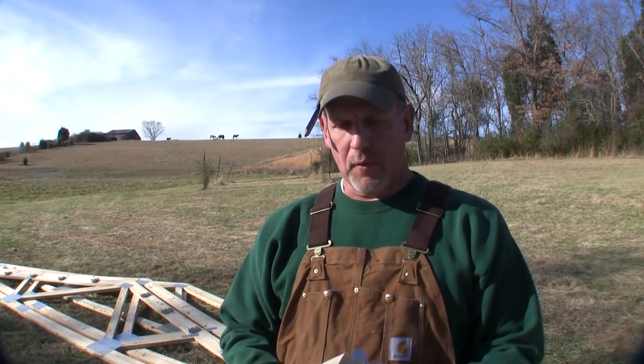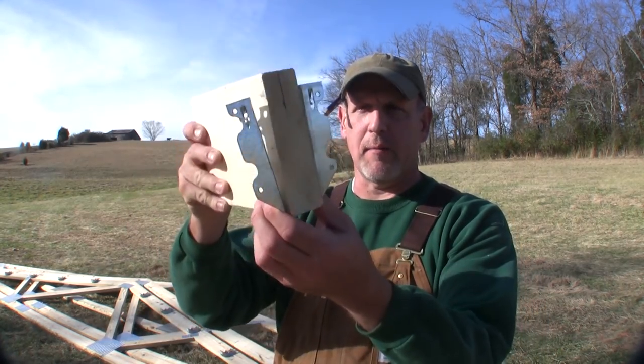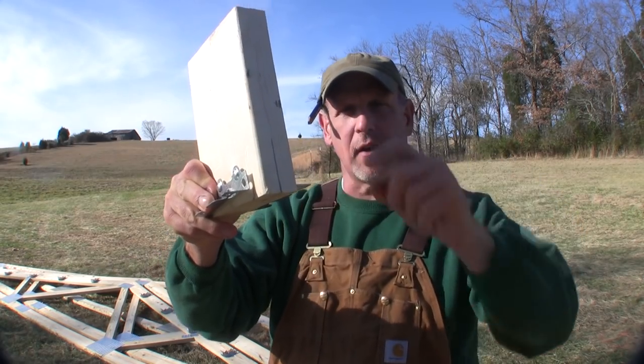Since I'm running 2x6 purlins in between these trusses, I'm going to use these joist hangers right here. I'm going to go ahead and nail them onto the trusses and have that done — it'll make it a whole lot easier to put the purlins in once those trusses are standing. My purlins are on 2-foot centers, so I started at the end of the truss and measured up 2 foot, 4, 6 and so on, making a mark. Then I took an old piece of scrap, made a mark dead center in it so I can lay it in the hanger, line my marks up, and nail the hanger into place.